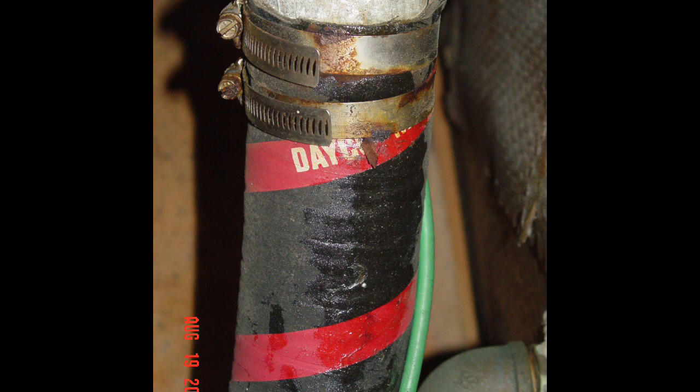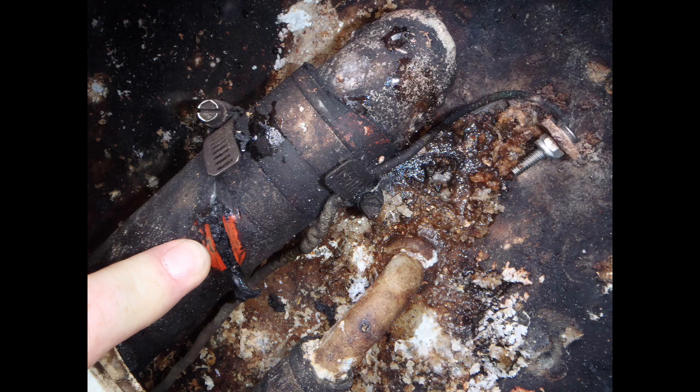You should access and inspect fuel tank fuel hoses for leaks and deterioration as part of your vessel's routine maintenance program. Check that each end of the hose is properly clamped and that the clamps themselves are tight and free from corrosion. Replace older hoses regardless of appearance as per the manufacturer's recommendations. If there's no specific recommendation, ten years is commonly quoted — so replace your fuel tank fuel hoses and the vent hose as well every 10 years regardless of how they look.